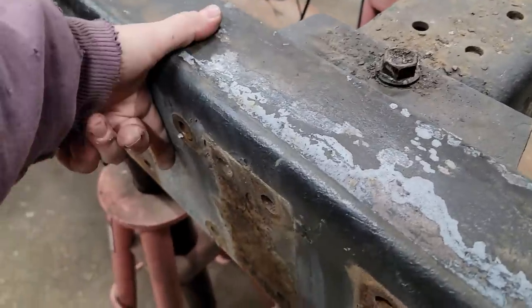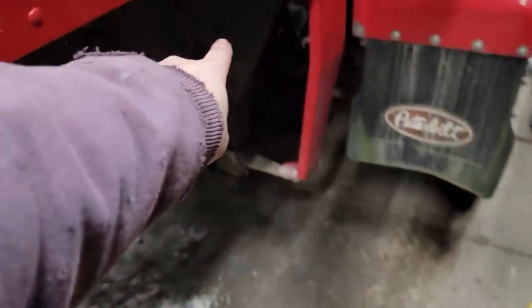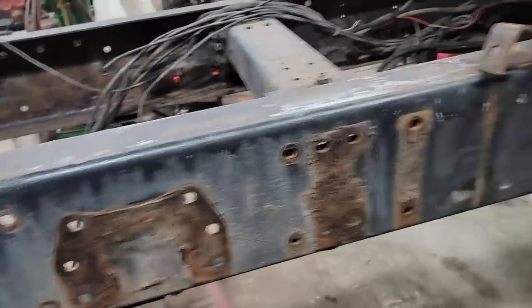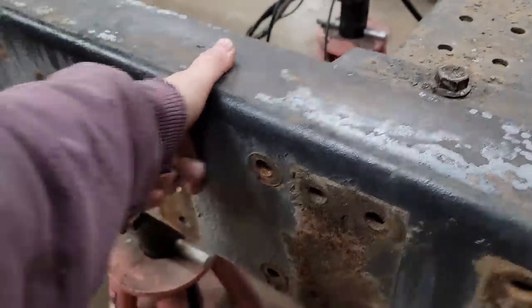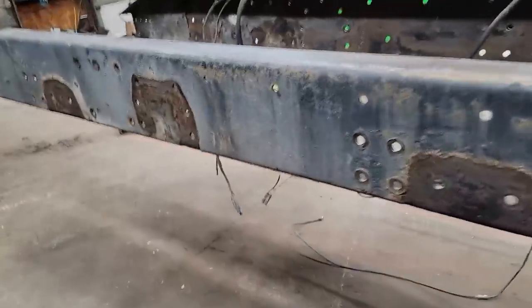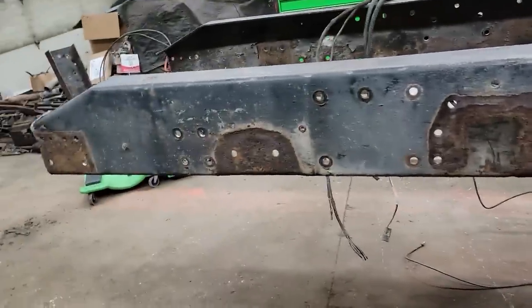and then entertain the idea again of the used truck frame like this as an L, cut the bottom off, run it from up here all the way to the back, beyond here, the extra 10 feet. And then I think I'd be happy with that. I think adding this would add quite a bit of strength, considering we're gonna have so many bolts holding it together. Probably only really needed to run that frame to this point, maybe to the front leaf spring hanger, but if we have it, I think I'd just rather run it the rest of the way out.